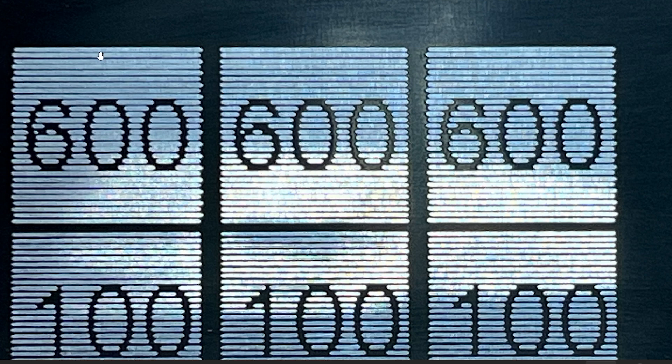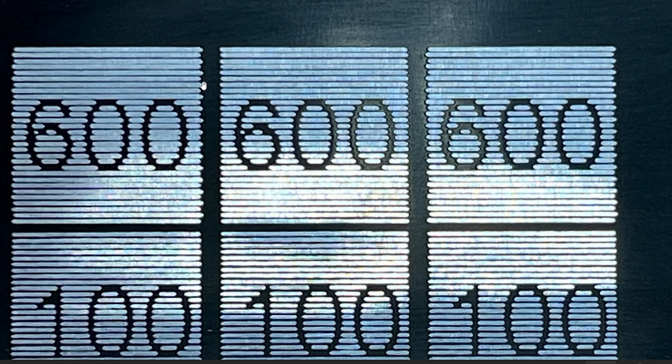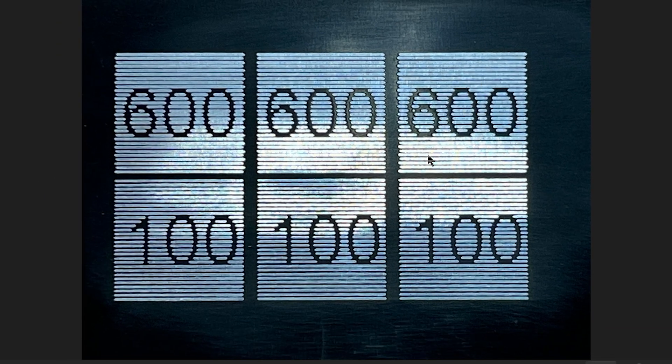What exactly is this setting? Basically, in a nutshell, the setting is the timing of when the laser fires. There's a delay — you can either reverse or forward the delay of when the laser fires in relation to where it is. What happens is the laser fires early going one direction and fires early going back the other way. This is a little anodized aluminum card — I had to take a picture and zoom in to see it.